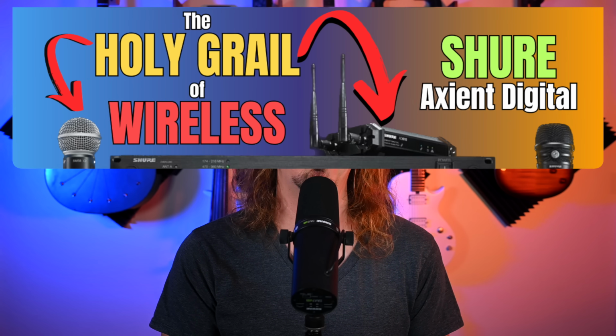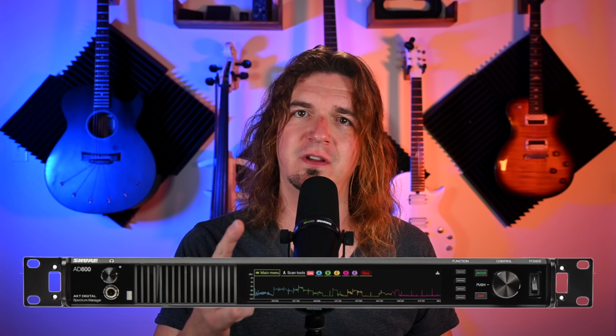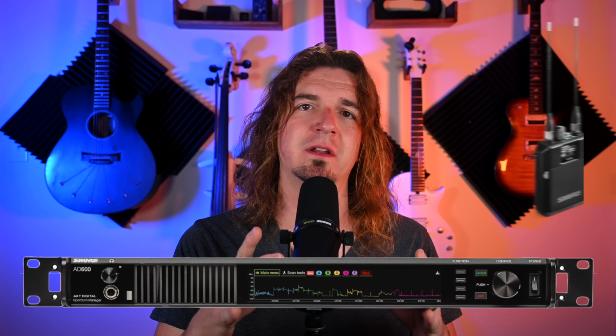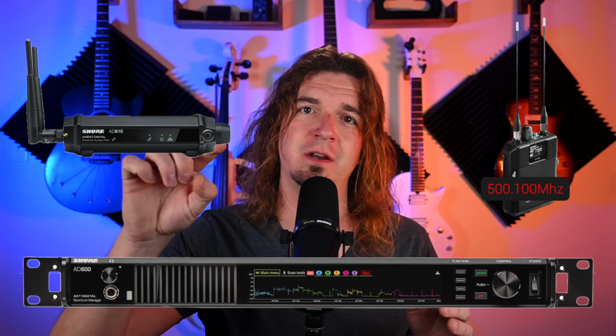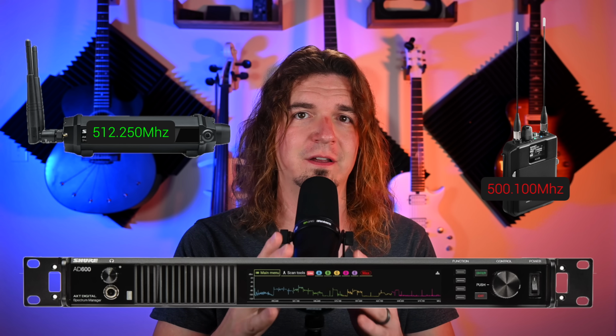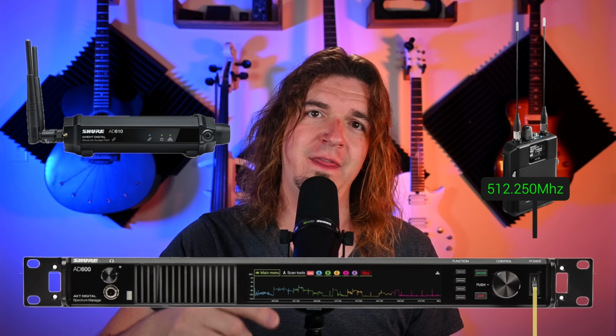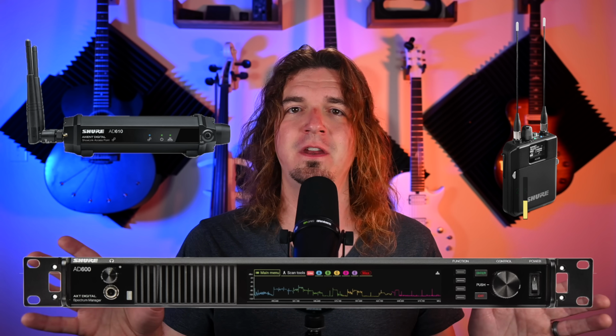I go over this in my Axient Digital video that I did, but the Spectrum Manager basically is always just scanning, looking for clear signals, and what happens is if a channel gets interference, and you have the Spectrum Manager and the Show Link, the Spectrum Manager is going to send a new clear channel to the system, to the wireless, and the Show Link is going to send that new clear channel to the musician on the stage. Then you don't have to go scan and resync and all that stuff.